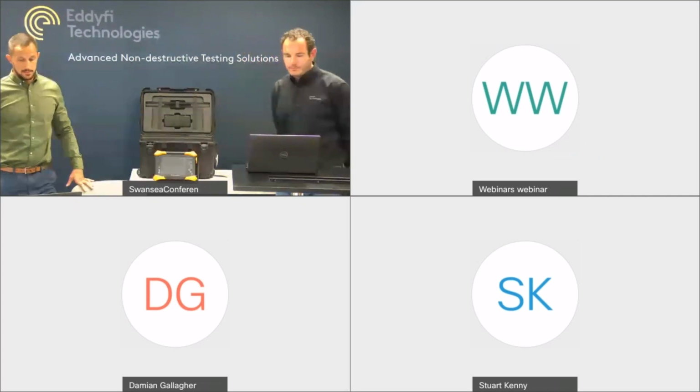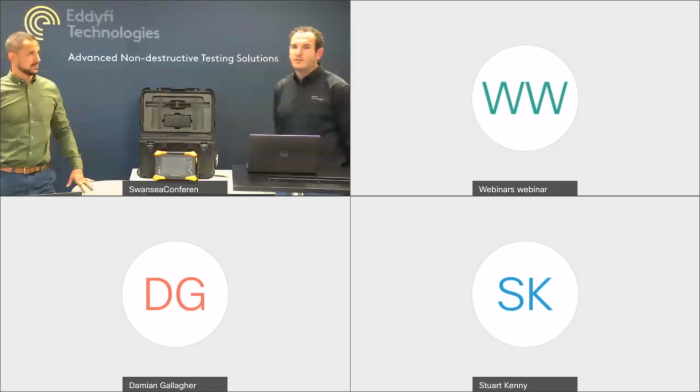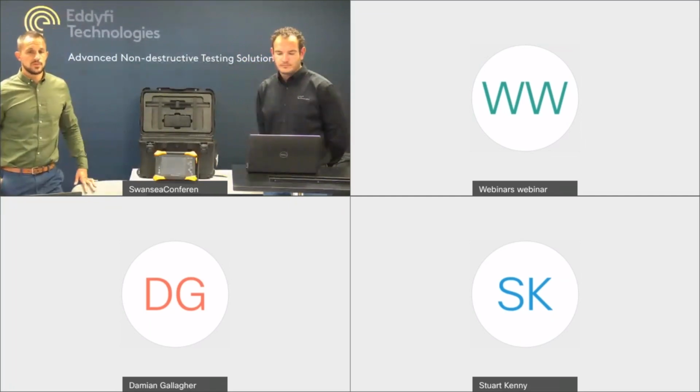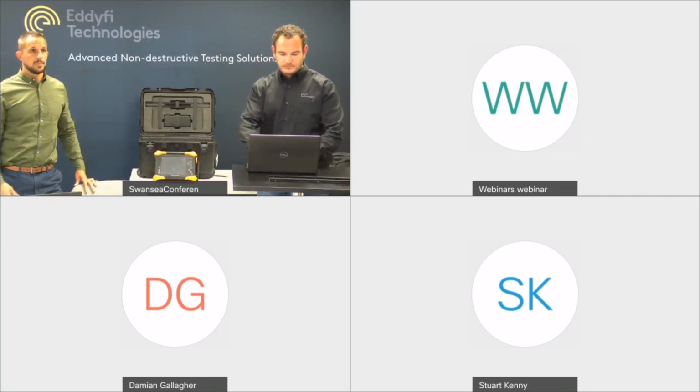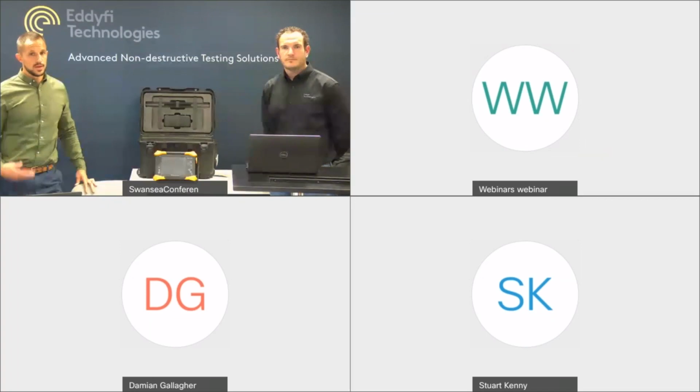Someone's asking about TFM FMC capabilities. Yes, we would mount into a standard tool post, and we put a solution package together for TFM. I think it's just an acknowledgement that the M2M phased array and TOFD instruments have a range, and some of them do offer TFM, FMC capabilities. As Gareth mentioned earlier, there's lots of information on the website about our capture software and its functionality, specifically talking about TFM. That's probably the best frame of reference, but if you buy the right M2M instrument with TFM capabilities plugged into the Link system, we can offer TFM corrosion mapping and weld inspection.